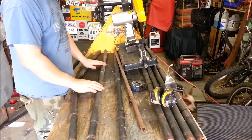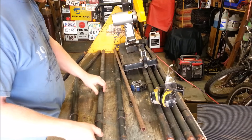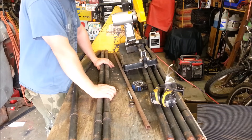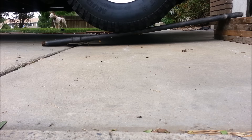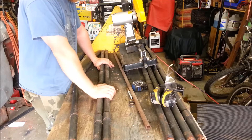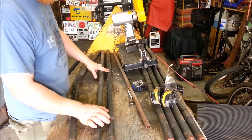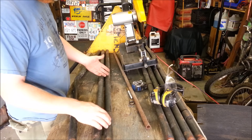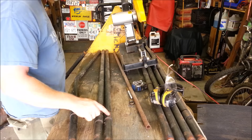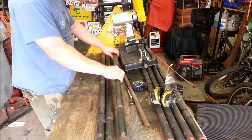This is the tubing I have — it's all gas line, a good solid eighth inch thick. This stuff's pretty heavy duty. I actually put four of these together and drove my Expedition up on them and they virtually didn't deflect at all — just pipe by itself. Even with these sleeves, it's acting like a lap weld — probably stronger, less likely to bend there than anywhere else in the pipe. I was going to cut those off but I want the extra length, so those are staying.